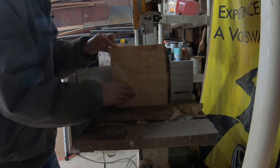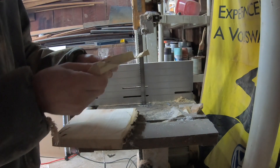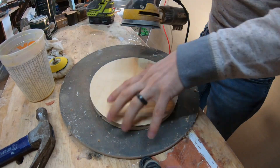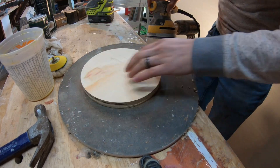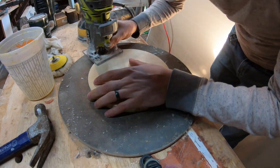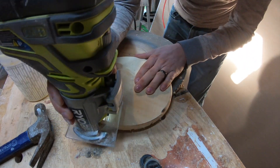It's a weird angle — my hand is really far from the blade, it just looks very weird. Make sure you don't cut your fingers — that's a big no-no. Go ahead and sand the edges really quickly, rough sand with 150 grit sandpaper. Then we'll use the trim router to route a quarter inch round over, so that the epoxy can flow over the side.